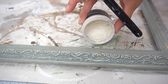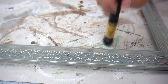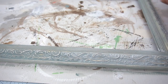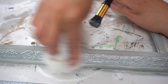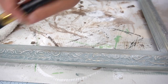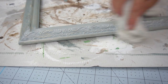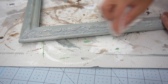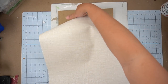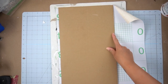This was already giving it a beautiful coastal vibe, but I came in with some of Debbie's Design Diaries white wax to give it a little more of an aged beach look. I took a stenciling brush, dabbed a little bit of the wax off, and rubbed it all over in small sections — then got my rag, removed the excess off the raised areas, and continued applying the white wax to the rest of the frame. While that cured, I took some grass cloth contact paper that I've used on so many other projects, because I love how it looks kind of coastal, and decided to cover the cardboard piece with it.